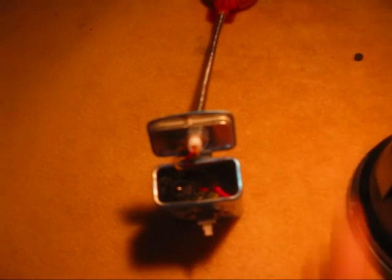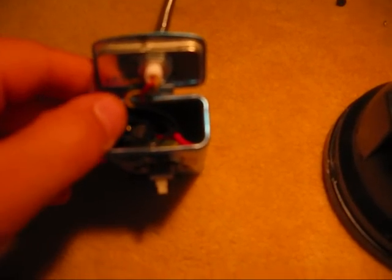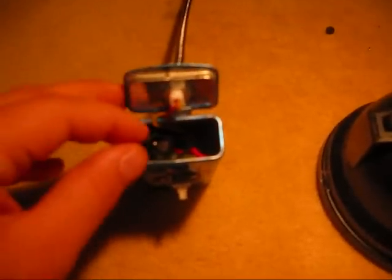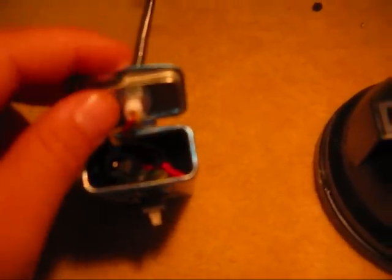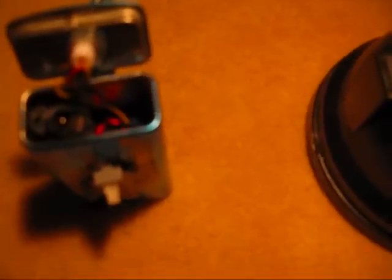This has got 8 LEDs, and what's really special about it — you can pop the top open here and you can see it's got a little plug in there that basically allows me to charge it off 12 volts, because I put in a 240 ohm resistor which lowers the voltage down from 12 volts to about 4.4 volts.